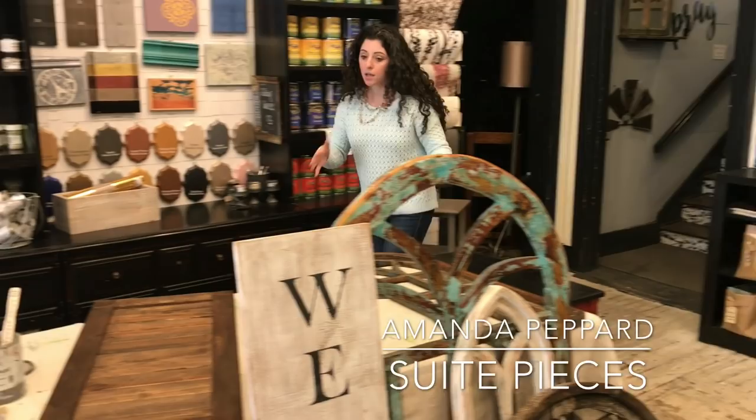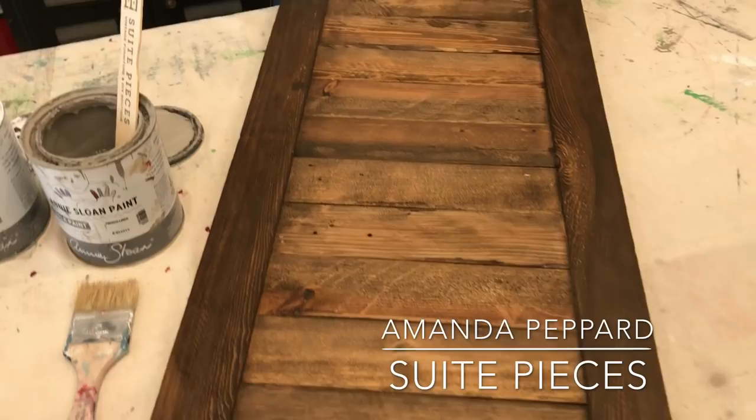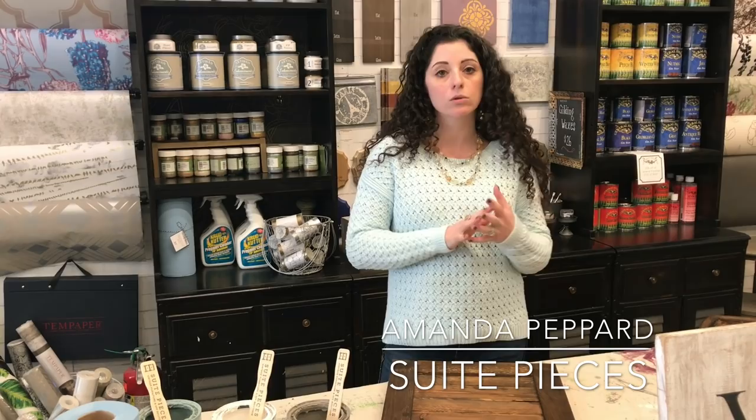One of the things you really want to look for is what kind of wood do you have. If you have wood that's really smooth and slick, a dry brush is a little bit harder of a finish to achieve. Whereas if you have wood that's a little more rustic-y with a bit more texture to it, it's a lot easier to produce a dry brush finish. Pallet woods, texture woods like oak that has a grain in it — those are really fun to create a dry brush finish on.